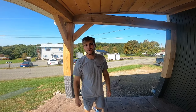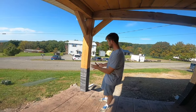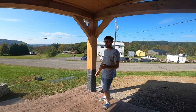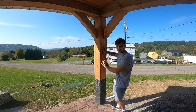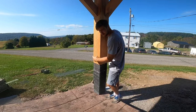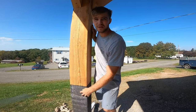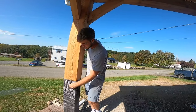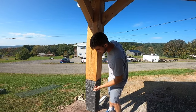In this video I'm going to show you how to scratch coat a wall for stone veneer. There are probably 20 different ways to start your job. For this wooden post, we need to make sure there's a barrier so the mortar isn't eating away at the wood. That's what this felt paper is for - you put that on all the time if you're doing any sort of wood. Then we're putting wire on here.